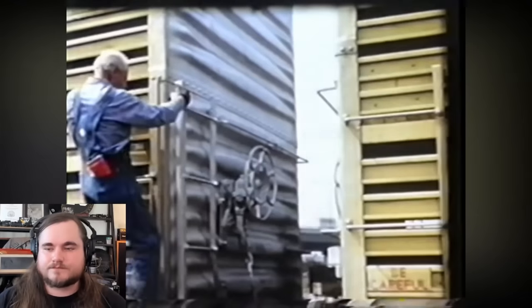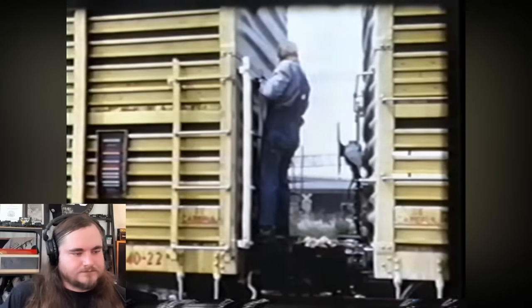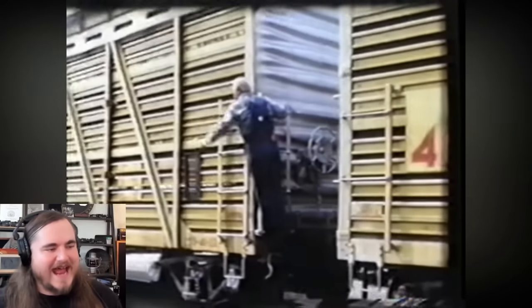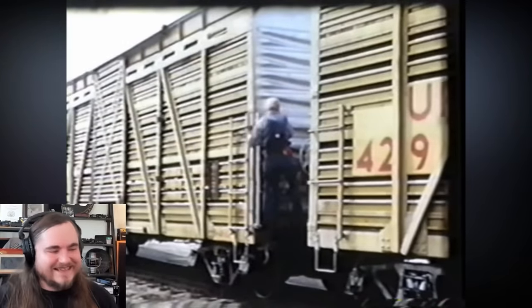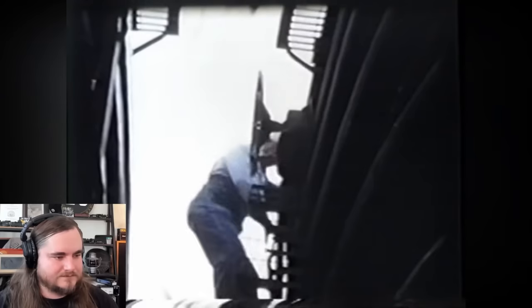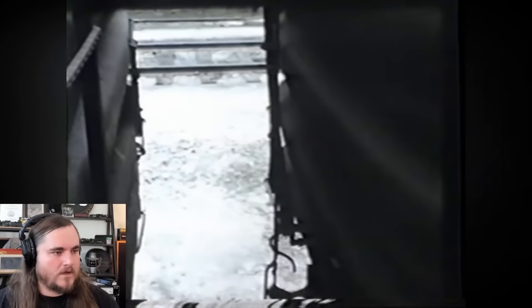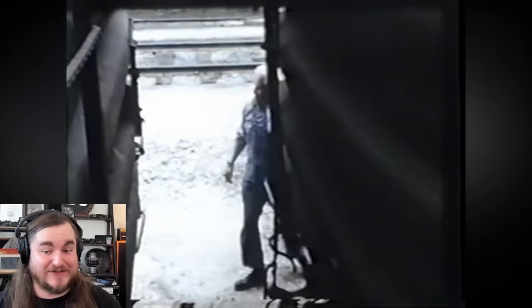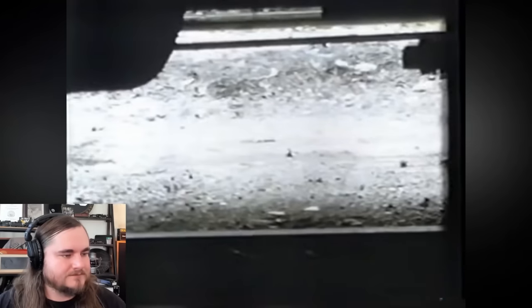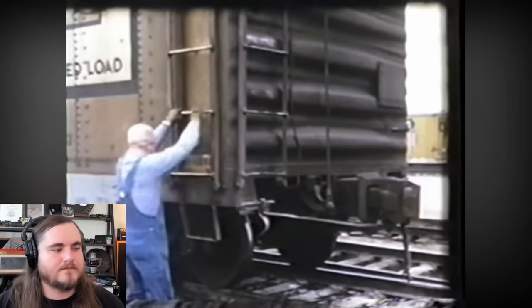Film: 'On this type of car, they've given you a safe perch off the ground in case of sudden movement. Moveable is the magic word. A car often moves without warning. On some tracks it'll move by itself - some yards and a lot of sidings are on a grade. Sometimes they'll fool you, they look so level. The best way to ensure a cut doesn't start downgrade by itself, or by some careless crew kicking a car against it, is to set enough brakes at the lower end to prevent a rollout and disaster.' That's very true. Absolutely.